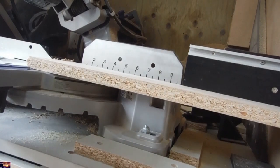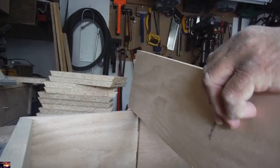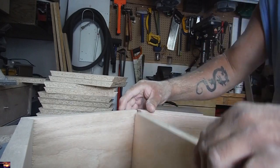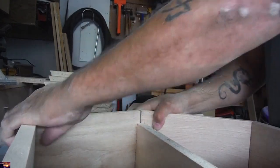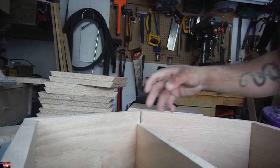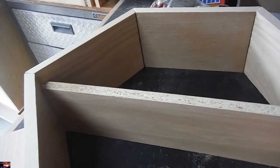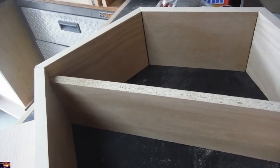What I found is, when you put it inside here, you actually won't need a jig because this will actually support it very well. So when you do the glue-up, you glue everything together like so and it will support it, so when you put your strap around to tighten it during the glue-up, it will actually hold it all together. That's my theory.